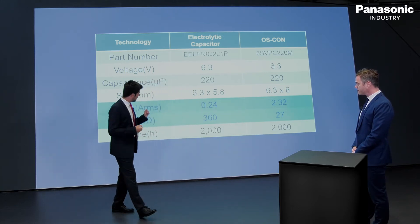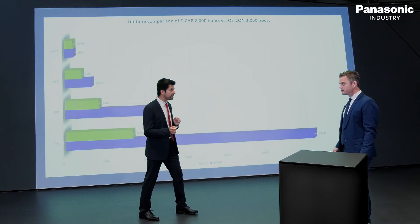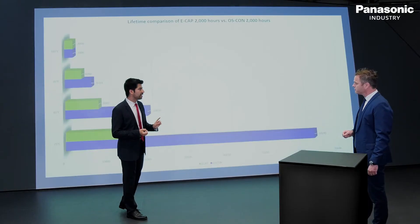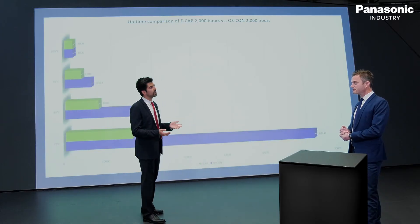And not only are the specifications I mentioned superior, but also in terms of lifetime. So really I want to double check — do we really talk about a one-by-one replacement here? Yes, one-by-one replacement, even with better lifetime. For OSCON technology, for every 20 degree drop in temperature, the lifetime is going to be 10 times more. So you tell me Arrhenius does not apply for this technology? No. With this lifetime you're going to get even better performance. Basically it makes this product ideal for different applications, from renewables and infrastructures and so on — all applications except automotive.